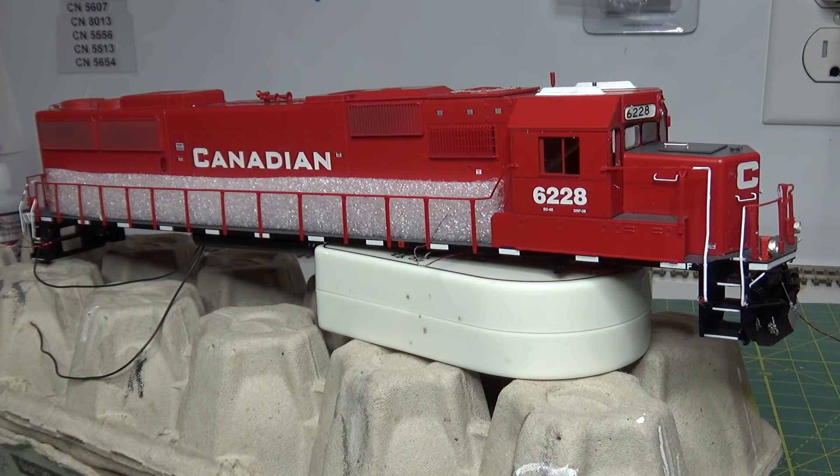The problem is light bleed from the LEDs. The LEDs are so bright that they radiate light in just about every direction — about 180 degrees around the SMD — and that light gets picked up by the plastic of the shell and radiates outward. You can see a glow through the shell on the outside. It doesn't look real at all, it looks really fake. I've found a way to fix it that I think would work on a lot of different models.